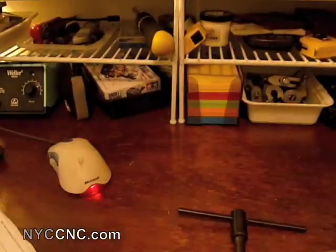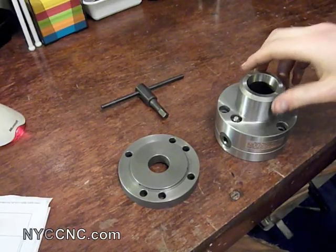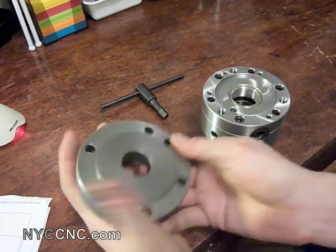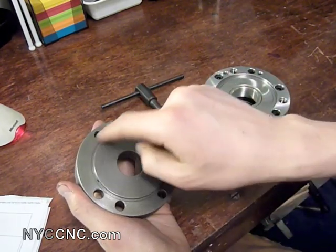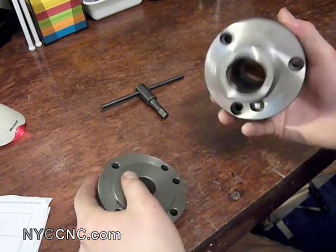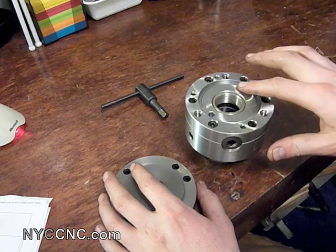The trick is that it's not in a ready usable format for the Bison chuck. The chuck manual specified the dimensions, and what you need to do is turn this lip — turn this outside diameter down to match the inside diameter. It's in metric. This chuck is made by the folks at Bison in Poland. I think it may have been 70 millimeters.